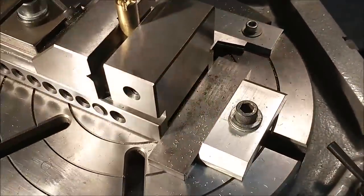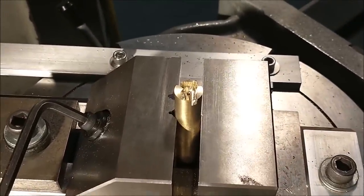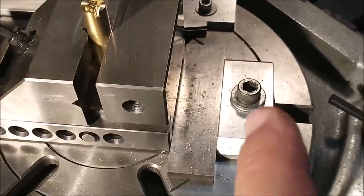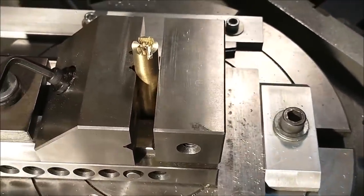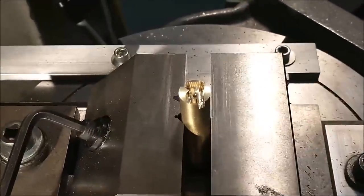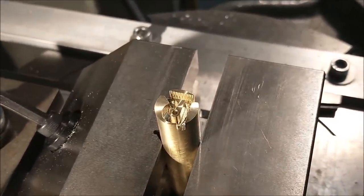And a stop on the opposite end as well. So any precision movements I need to do to shift the center of this rotary table, I can do with pins, blocks, shims, whatever, on both of those two faces. So let me grab the appropriate blocks, sneak them in there, we'll come back, and we'll put a radius on that back corner right there.